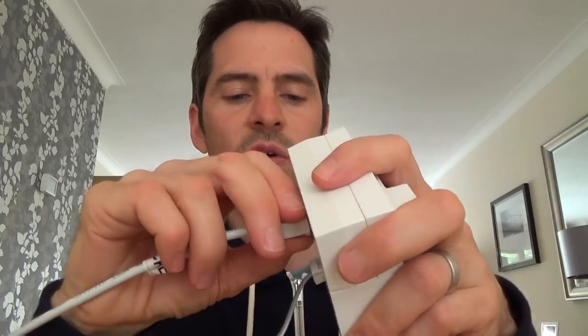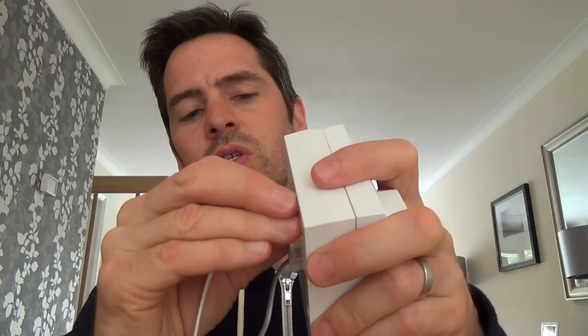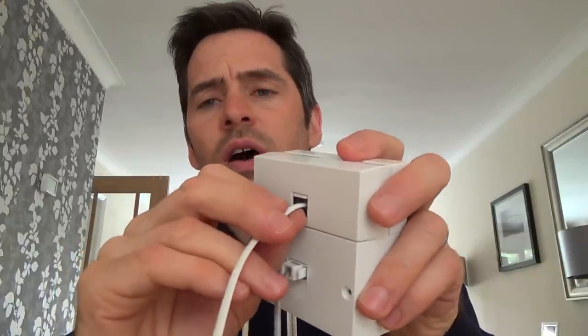Now the reason I put an RJ45 in is I think an RJ45 plug always fits better into an RJ45 socket because there's no play. It fits nicely — the pins haven't got a chance to go anywhere. There are only eight contacts in there and the RJ45 plug has eight contacts, so when it goes in there's no chance of putting it in wrong or sliding onto the wrong pins. Especially with wear, sometimes when you try to put an RJ11 into an RJ45 socket it can go in at an angle. There's more chance of making a bad connection than putting an RJ45 plug into an RJ45 socket, which is designed to take both an RJ11 and an RJ45.